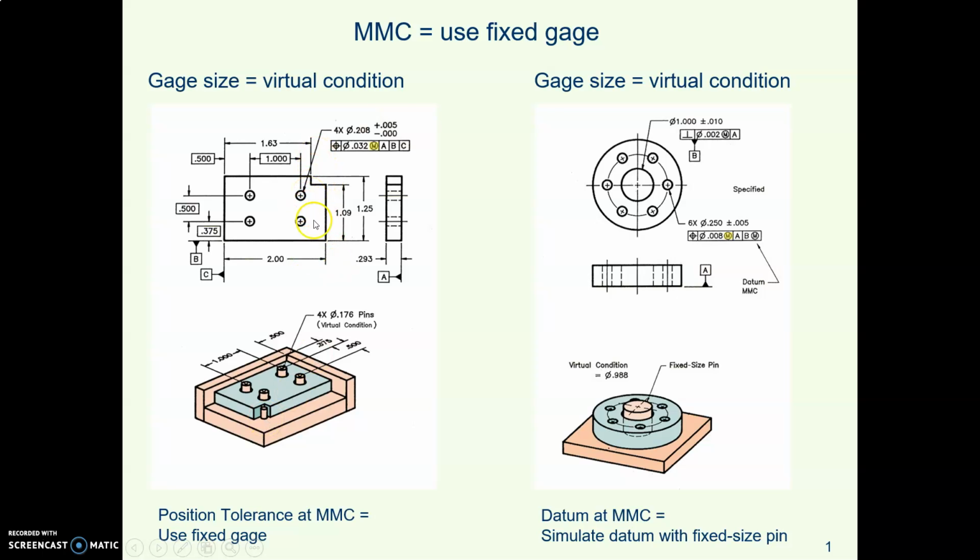That notch, well, let me see, this part, you could flip it upside down and still get it to fit in that gauge if you didn't have this little pin in that corner. And that pin is called a foolproofing pin. Very handy time-saving device for inspectors. If you have a way of putting foolproofing features in your part, do it.